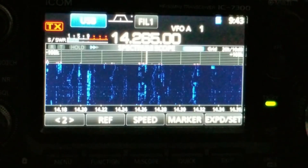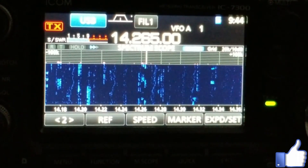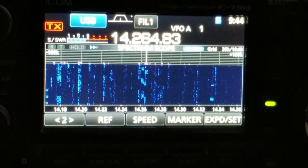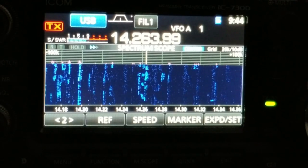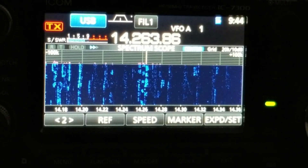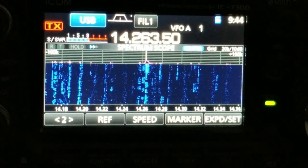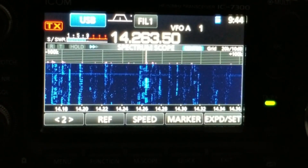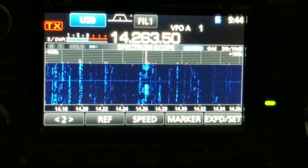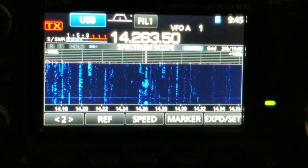We are back. I have not touched the radio, but take a look at what I see. It really truly is amazing — there are some weak signals. These could be European or something like that. Let's see if we can pull one in. Now as you could tell, this is European — this is 20 meters and we're able to hear Europe during the middle of the day. That's just one and a half kilocycles down from where we had all that noise just a second ago, and I wasn't seeing that. It's amazing when you see that, and all I've done is turn off the power to my house.